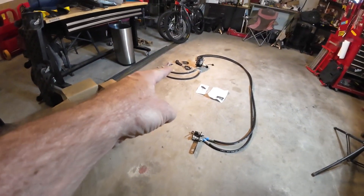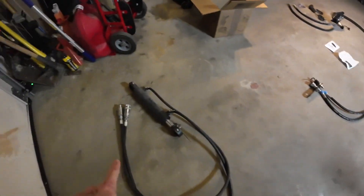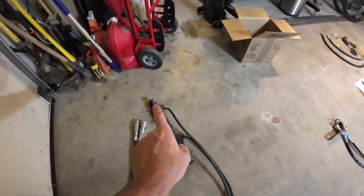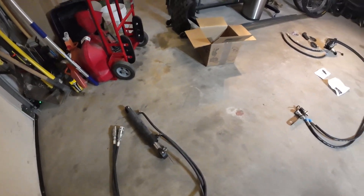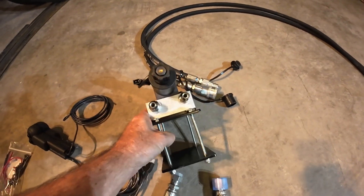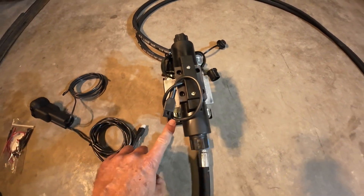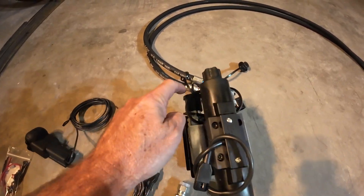The pressure goes on one side of the cylinder and drives the piston one direction. If you hit the other button, it sends pressure down the other leg through the other hose, putting pressure on the opposite side of the piston and pushing it the other direction, making the cylinder shorter. It's really simple — there's nothing complicated about this at all.